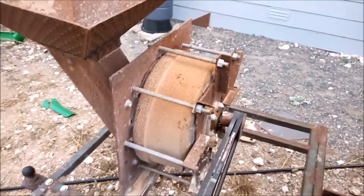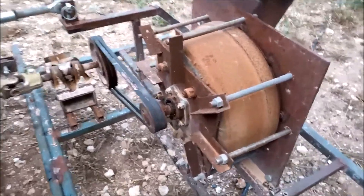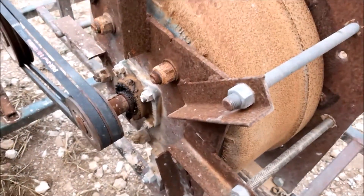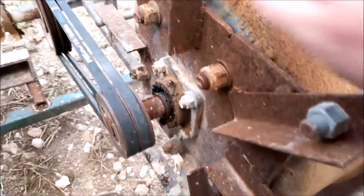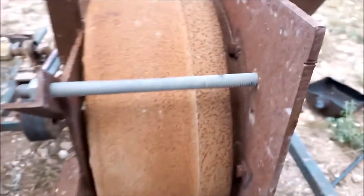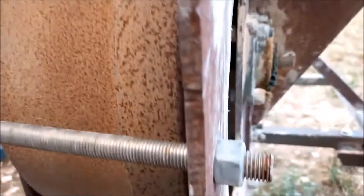The actual body of the crusher is an old brake drum from a truck. I just reused the main bolt holes that are already there and made up this housing plate. I've got locator lugs that locate all around the whole diameter, and that helps locate it so when you hold it in place with your threaded rod, it doesn't move about.